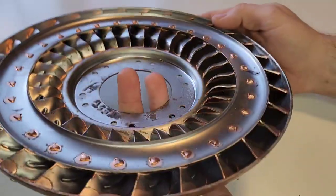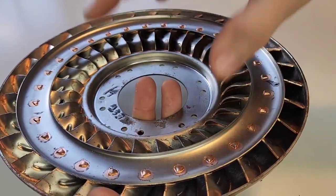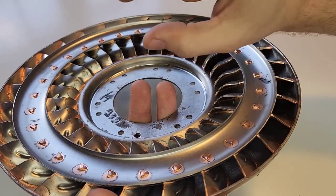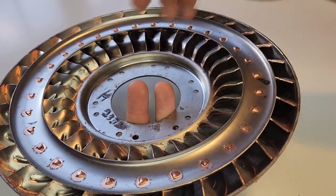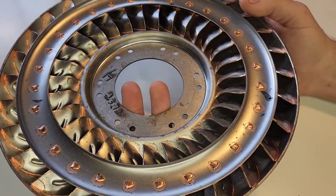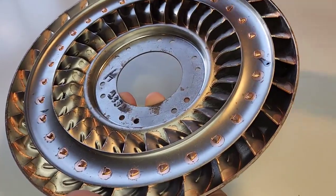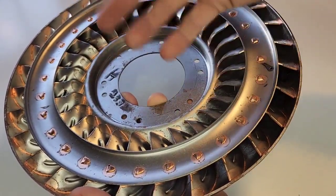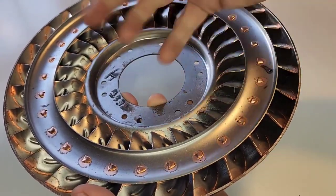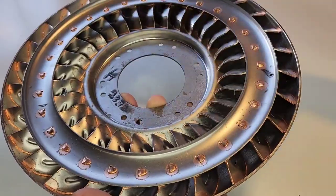The reason they're using fluid is because it's a viscous coupling - it's not a direct coupling. You need some flexibility between the engine and the gears. That way, when the transmission is making that shift, that slight abrupt stop on the transmission doesn't stall out the engine or cause timing issues or, in the worst case, put a lot of stress on the crankshaft or the pulley or the crank inside. So this acts as a shock absorber - think of it like a rotary oil-filled shock absorber that takes those spikes out and smooths it out to the engine.